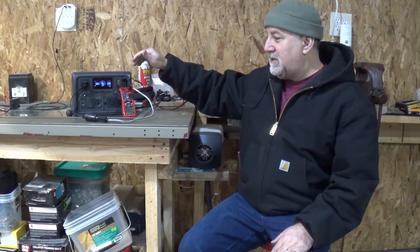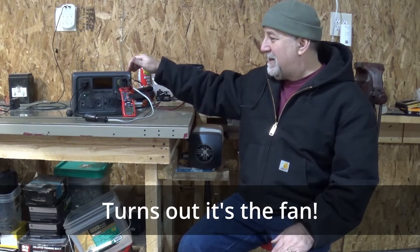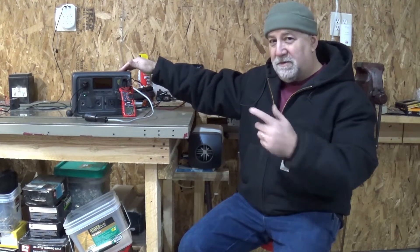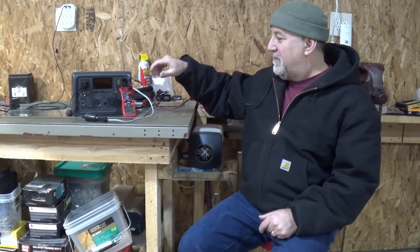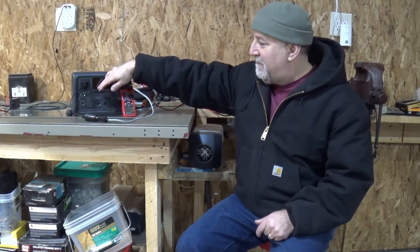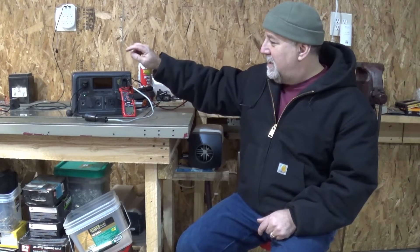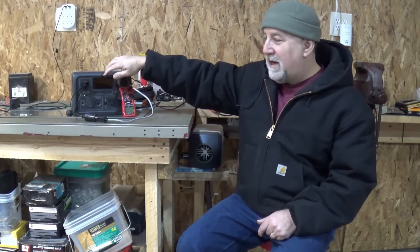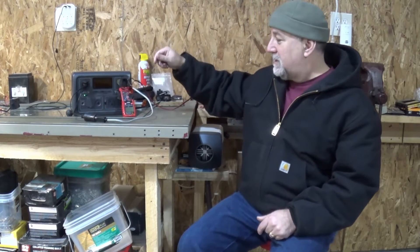I have been able to start the heater on the DC side. It does make a strange noise when it gets close to pulling just about 10 amps out of the power bank, but it holds on tight. I did rig it up before and it ran. The setup wasn't real pretty and I'm not crazy about it. I've got a 5521 plug coming and I'm going to use that instead of the cigarette lighter output — I think this is a more stable output. I had to use a splitter to get the cigarette lighter adapter set up.